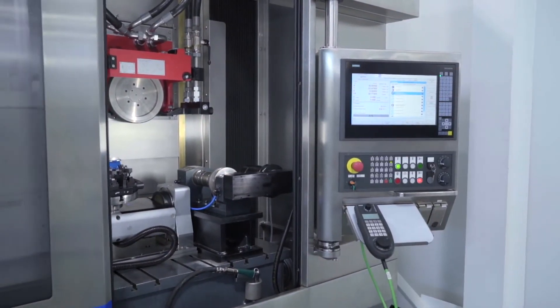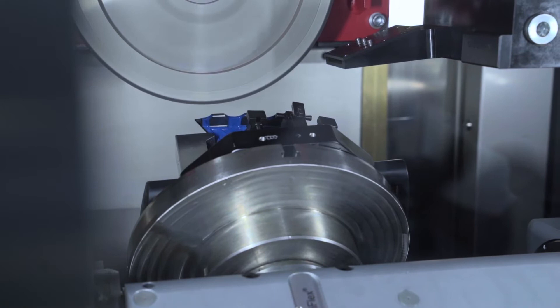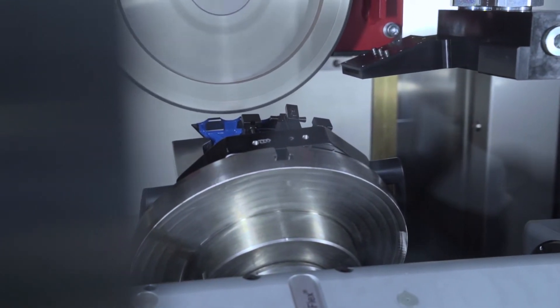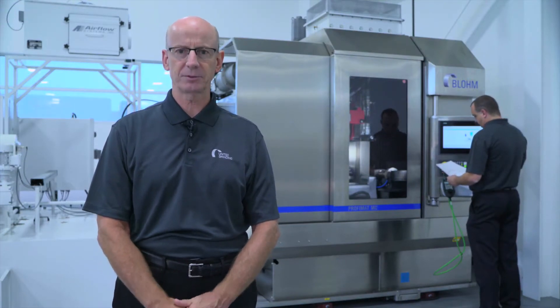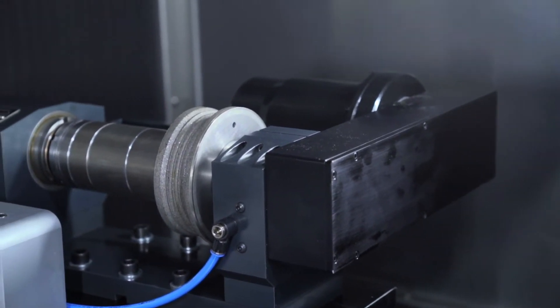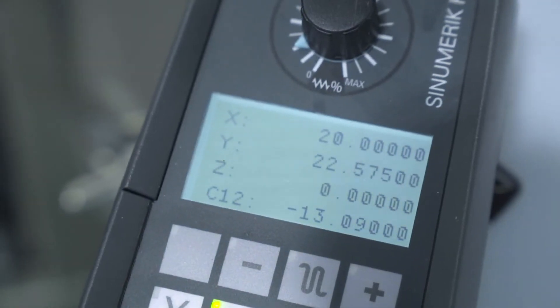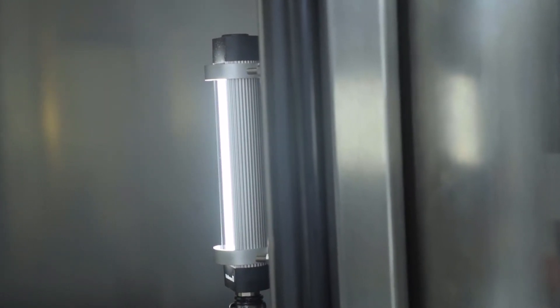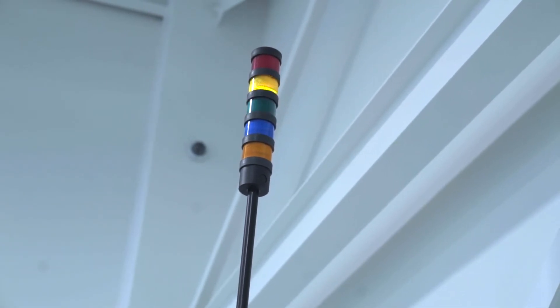Standard items on the MC Arrow include the following. Five-axis movement is achieved with a high precision Lehmann 2-axis indexer with a large diameter rotary face plate with double key ways. 12 or 16-inch OD grinding wheels can be used with options up to 8-inch wide wheel packs. An 8-inch wide table dresser is available for profiling wheels using both a profile dresser and a CNC diamond point. A multi-zone coolant delivery system is available with M-code control of separate zones. The remote operator pendant with full operation of functions provides the operator ease of setup. Extremely bright LED lighting provides ample illumination within the machine enclosure, and a machine end-of-status light indicates machine status.